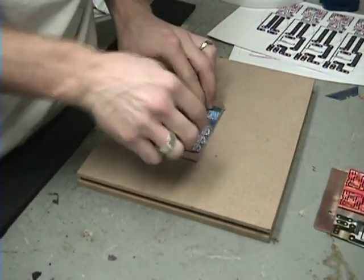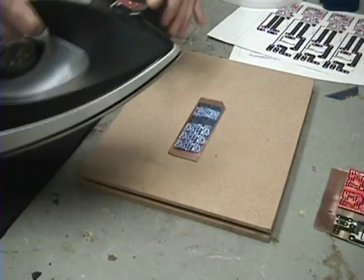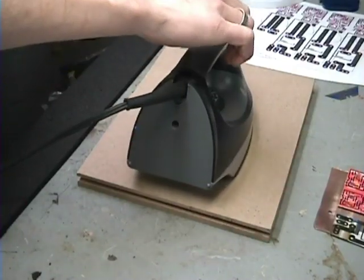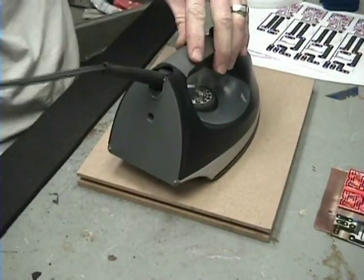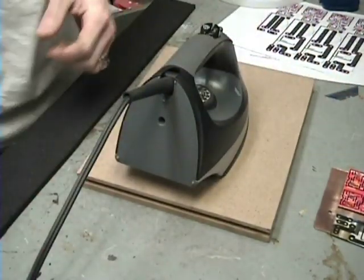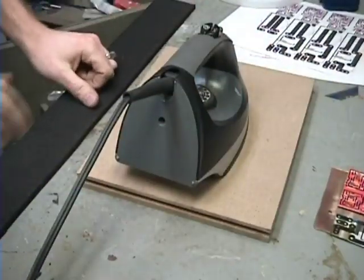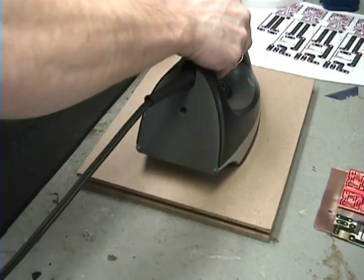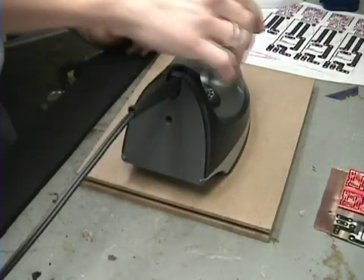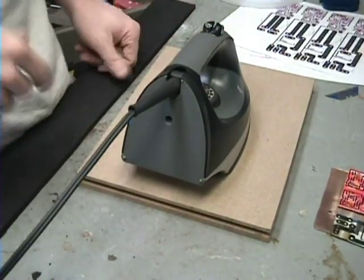I'm going to have to be on the holes — that's fine. You don't want to push down and smear real hard because you'll mess it up. What I'm going to do is just set it on here and let it sit for a minute. If you push too hard, the toner melts and smashes out — like too much glue oozing out. I got it really really hot one day and it worked a lot better than when it was cooler. I don't know exactly how long to keep it on there — you just have to check it.